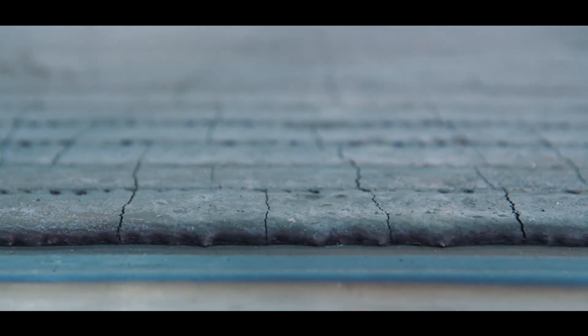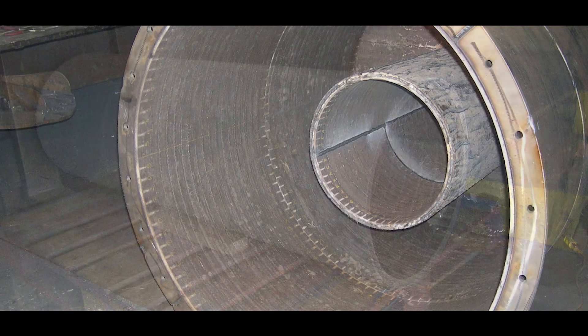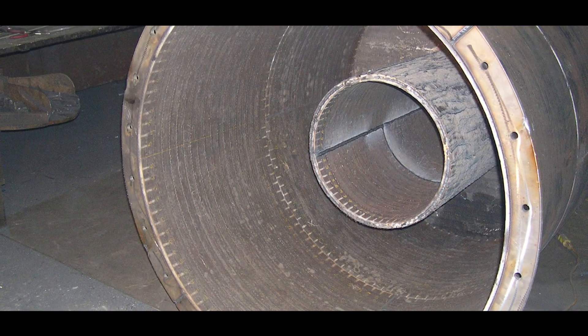It is chiefly used as a liner material. The overlay itself, however, has no structural integrity. It can be used in fabrications on its own — for example, in formed pipes — but any welds or seams that require structural security must be adhered to the base plate and not the overlay itself.